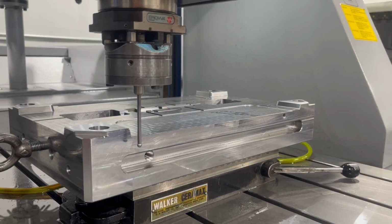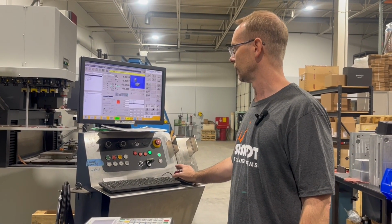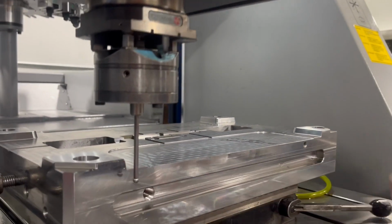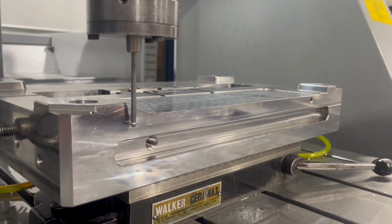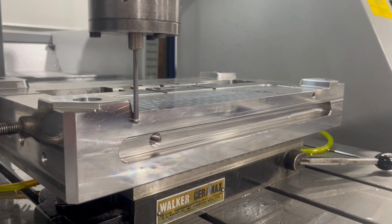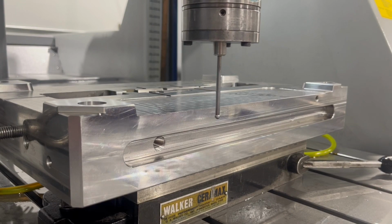I always recommend, when you're doing this type of checking with the machine, to run the whole process twice. It's very common that you will get an error because of a piece of dust on the block. I always wipe it with my hand to make sure there's no dust. I've been bitten by it. You're off like 1/10 of a degree or something very small, and you can't figure out why. It could be very well because of the pickup. So this is critical. Run it twice, and then we're going to check it with the indicator.